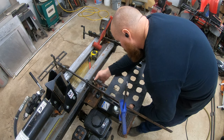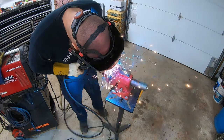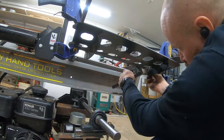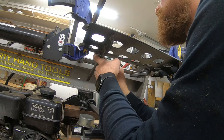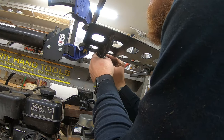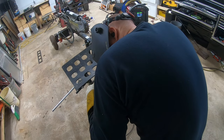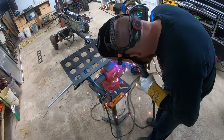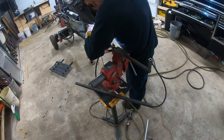I'm going to have to fill the gap in between the table and the beam, so I'm making brackets to use the old table off the splitter. If I needed to put this all back to the way it was, I fairly easily can - that's why I'm just bolting it on instead of welding everything. On the back there were two other holes; I just put bolts through and welded the nuts to the bracket.